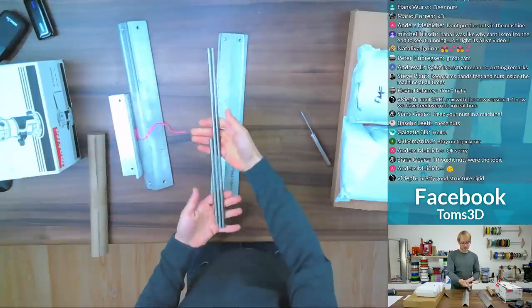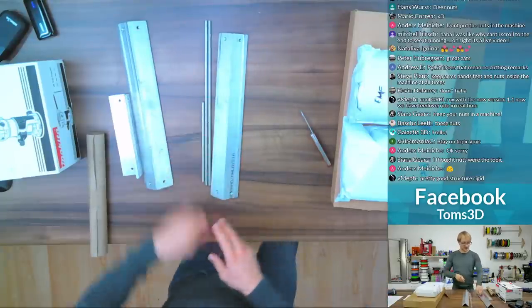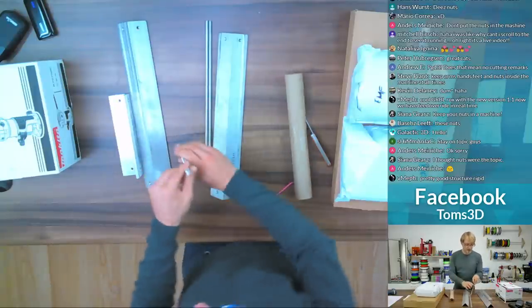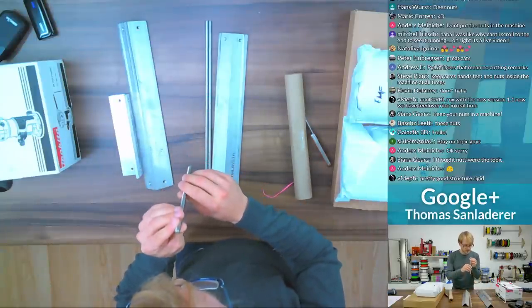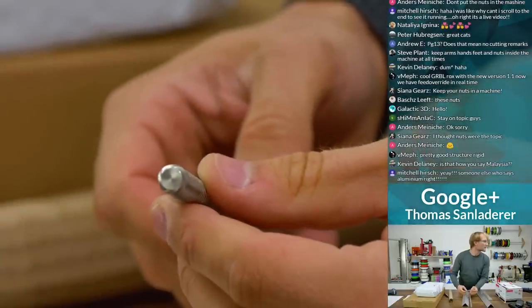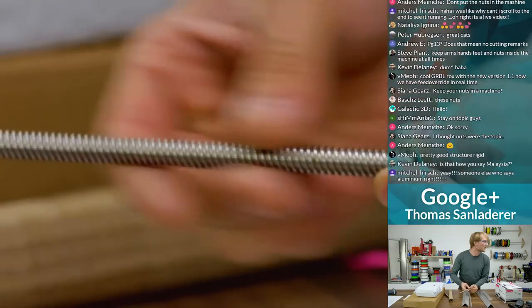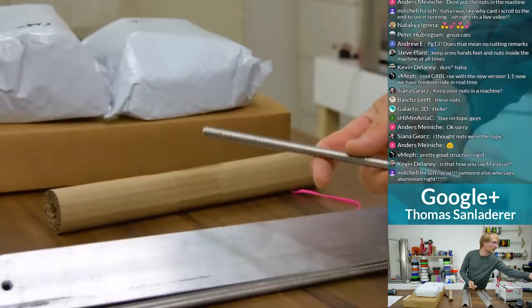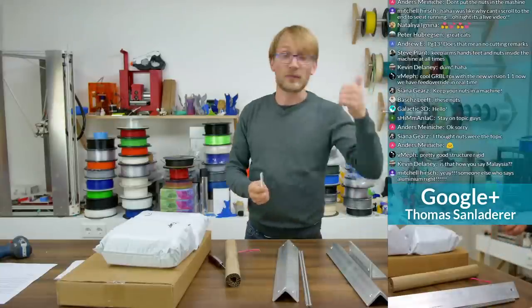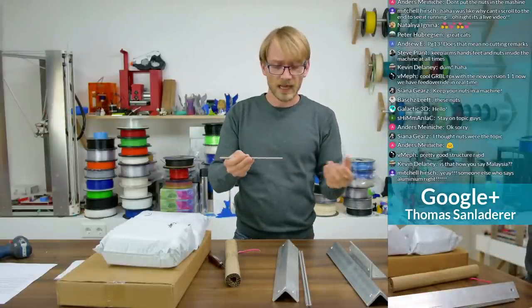materials. So three, I'm thinking these are Acme, so these are imperialistic threaded rods, but they are fairly high pitched. They are a four start, similar to what you're seeing as Z-axis in 3D printers these days. If it would actually focus, there you go, you can sort of see the four starts, but very high pitch.